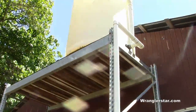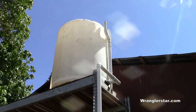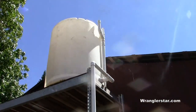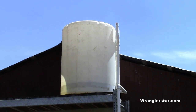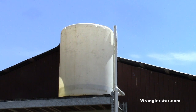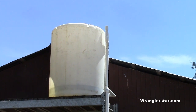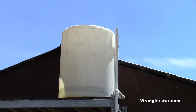We have a 350-gallon tank up there. I originally designed it to put two 500-gallon tanks, but I got this one off Craigslist and it's been sufficient. Mrs. Wranglerstar doesn't use the whole tank to water her garden. In addition, when the tank fills up and it's full, I've built an overflow that goes down and waters my orchard. The ram pump will fill this tank — it pumps 150 gallons every hour, so a 350-gallon tank takes a little over two hours to fill. More than enough water to provide for the garden.